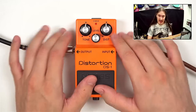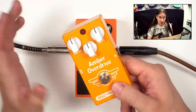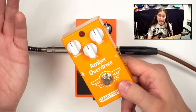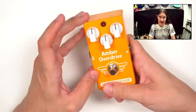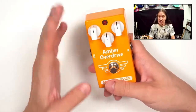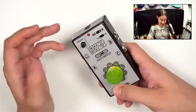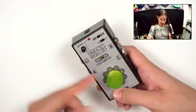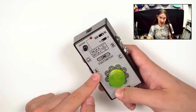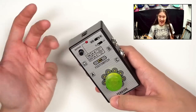Using this method you can rule out pedals with active bypass, but when it comes to the passive type it gets a little tricky, because this method will not be able to tell you if it is actually true bypass — only that it is a passive type. In a true bypass pedal, when the pedal is off, the input has to be routed directly to the output without any interference or other components connected to the signal chain. But in some pedals with passive bypass, even though the sound easily goes through without power, some part of the circuit always stays connected to the signal chain and may affect the tone. Therefore these kinds of pedals don't count as true bypass.